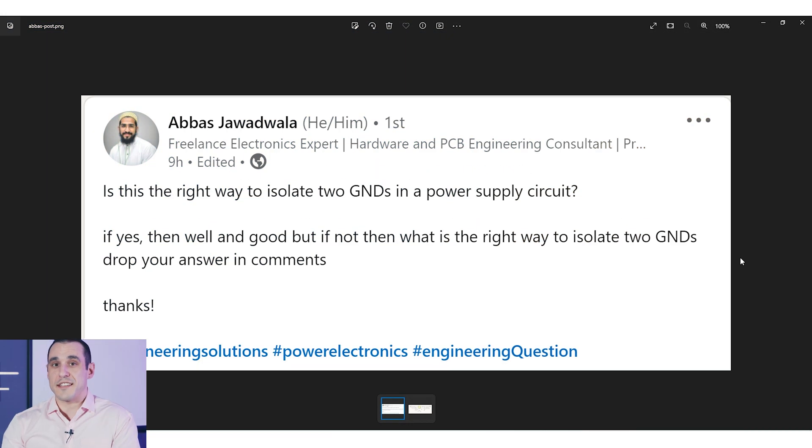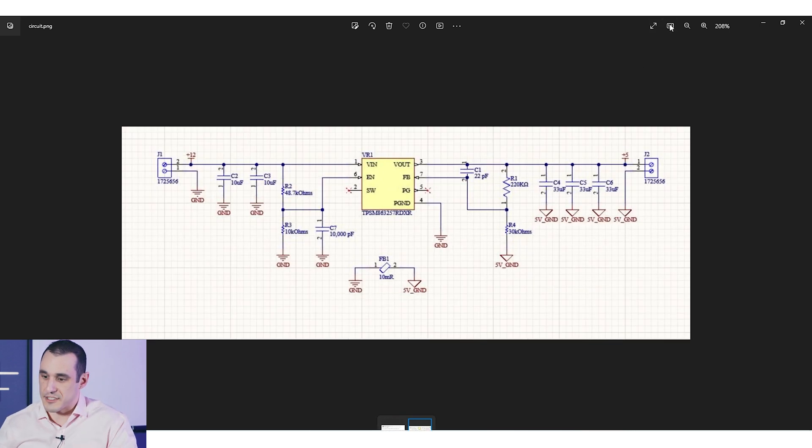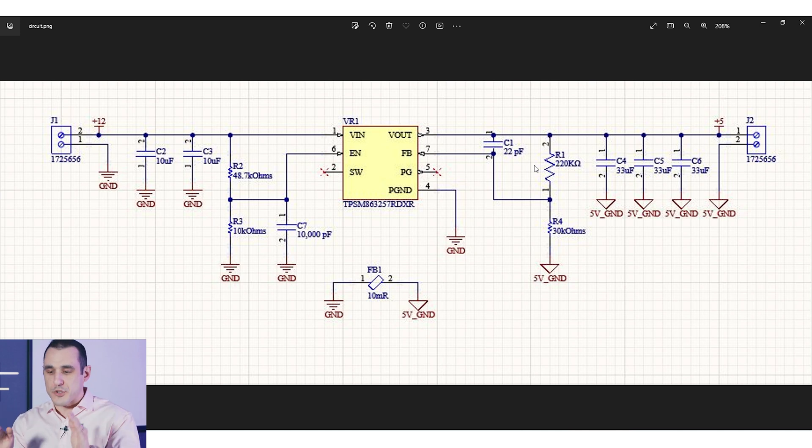He also posted a circuit from an Altium schematic sheet. That circuit is here on screen. It's a little blurry because it has to be enlarged, but you can see what's going on. We basically have a voltage regulator taking in 12 volts, some input capacitance, we step down the voltage to power the enable line, output at five volts with some output capacitance, a feedback loop, and two different ground nets linked together with a ferrite bead.